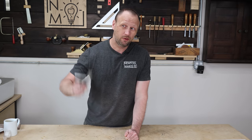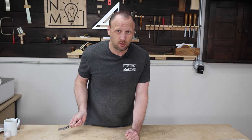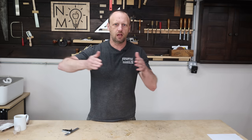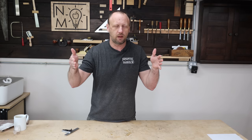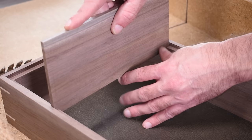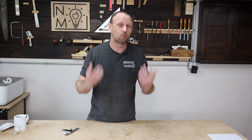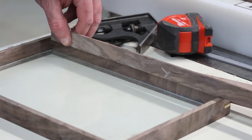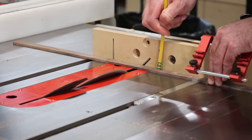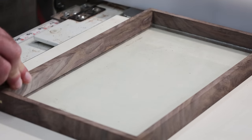Lesson number three: I really wish I would have known I didn't have to measure everything. A lot of times, our measurements don't even matter. When I first started woodworking, I thought you had to measure everything. If I was making a box, I'd measure my boards for the right size — understandable. But then if I had to put compartments inside that box, I would measure those pieces too. That's not necessary. Instead, we can use relative dimensioning — just cut a piece until it fits into place.